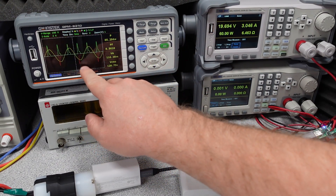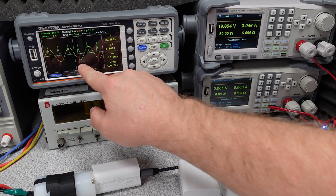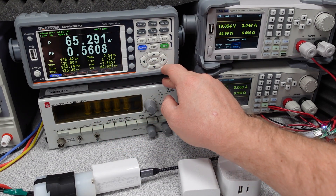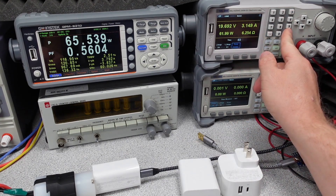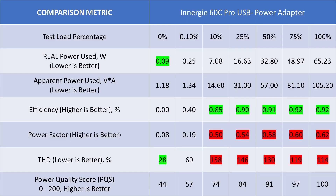The adapter turned off when overloaded at 74 watts, which is pushing it a little far, but at least it turned off. The issue is a 65-watt 3-amp rated cable might not be up to the task of the extra amperage, so things might get a little warm. When we look at the overall data, the idle power consumption is low and quiet — a real win. The general performance is bad when taking into context the lack of power factor correction. The adapter meets Department of Energy 6 requirements, and the voltages were all strong and within the USB Power Delivery specification.